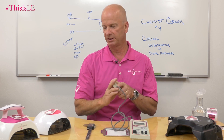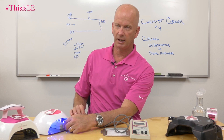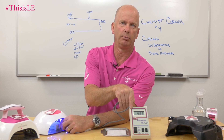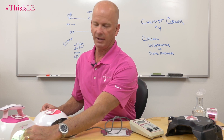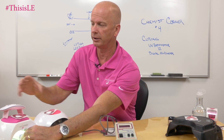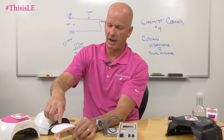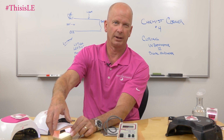Let's start by testing our LED dot. If I put the sensor inside the LED dot, about where your fingernails might be, we're running right now about 5 milliwatts per square centimeter. If we take that and put it inside the plus light, we're measuring right about 4.2 milliwatts per square centimeter, which is actually fairly good. And then if we take this little mouse light and turn it on, we're measuring about just under 4 milliwatts per square centimeter, which really surprises me that it's actually that good.